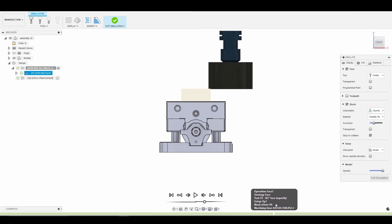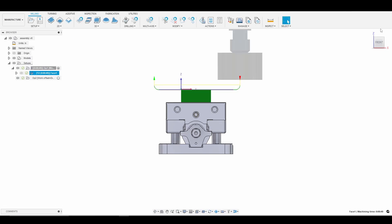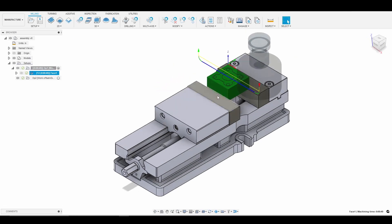We're not going to leave any tool marks. So that's good. There are our two passes, and we only added a few seconds to the operation. I'm happy with that. So that's it for our first tool path. Now we'll go to our second tool path, which will be our 3D adaptive clearing.